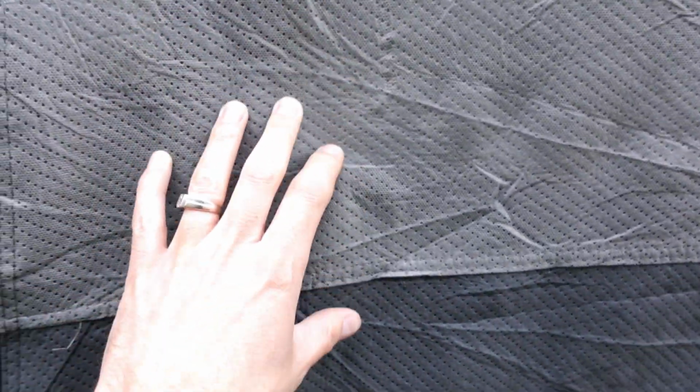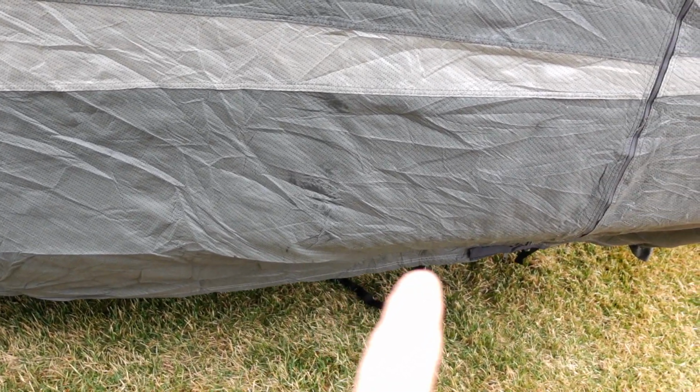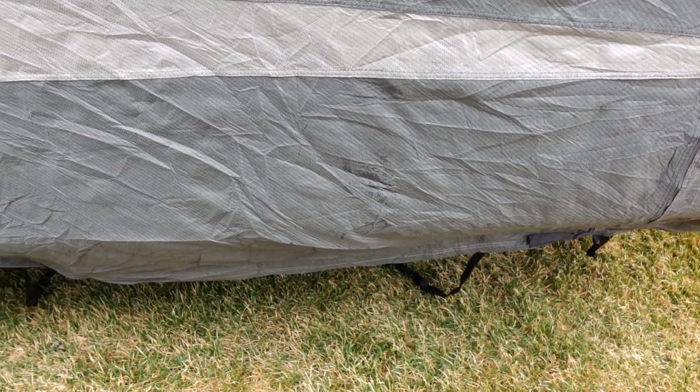be sure that you do not draw that as tight as you do the other sections. Leave a little bit of slack in this area, because the more you pull on it and tighten it up from the other side, the harder that's going to pull down on that area, and it could cause a tear in your fabric. Same thing where the end of your gutters stops, there's also a stress point. So when you come down right below that, wherever your strap is located, which is in this area here, just leave a little bit of extra slack.